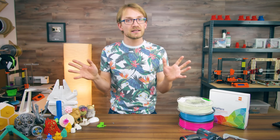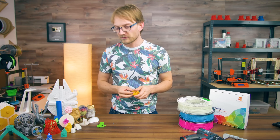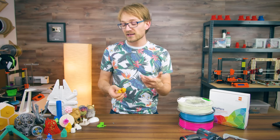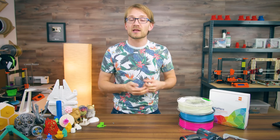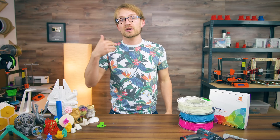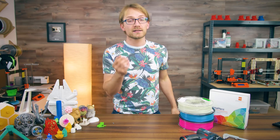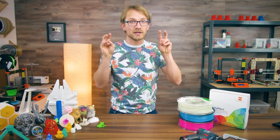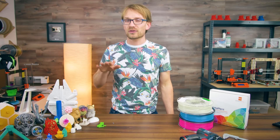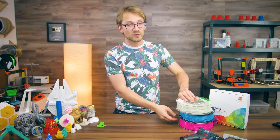You might have read that some PLA colors will always have their own printing properties — like yellow PLA will always droop more than blue — but that's not really the case. If manufacturers use the same basic resin for all colors, the difference should be marginal. However, if a colorant does influence properties, for example because it absorbs more moisture than others, you might observe the same behavior across many different filament brands. That's because there are only about three or four big manufacturers that supply most smaller brands with raw materials — so it's actually the same stuff with just a different sticker on it. Don't worry about the exact filament color too much; they can all print really well, so just get ones that you like.